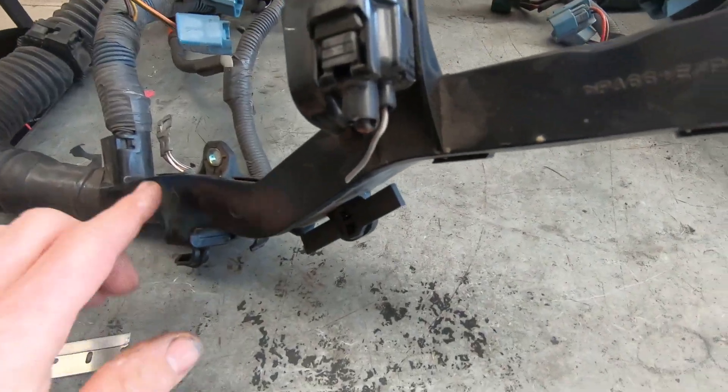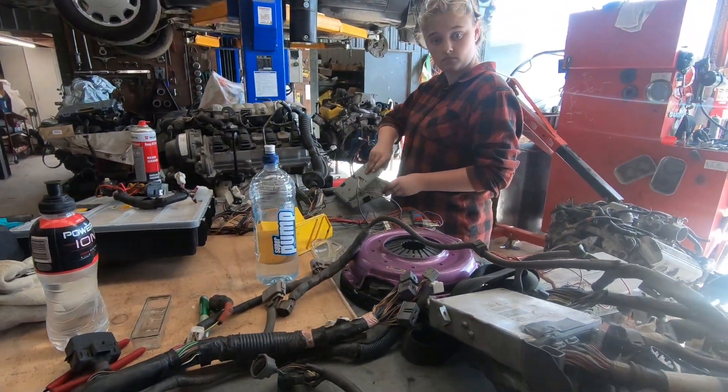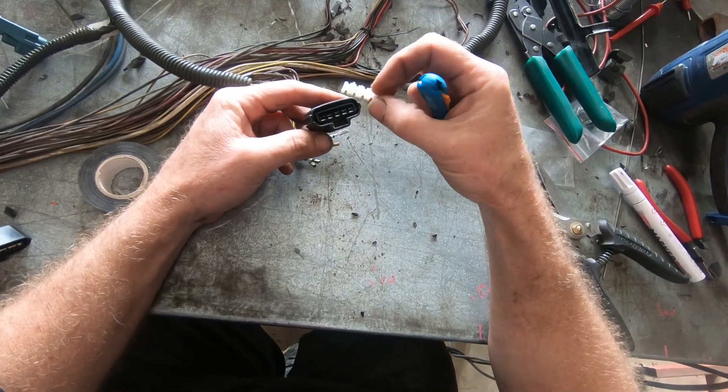There's some repairing for me to do, but first I'd like another set of covers so I'm going to harvest them off this job over here. My assistant will harvest the covers off this one. This loom is going to replace a UZS 131 loom — that job's coming up. I don't recommend mixing and matching looms, but when you have to, you have to. My assistant is going to harvest the plastic covers off this nicely so when I convert it over to a gen one loom, we can put a set of gen one covers on it. I'm starting with the igniter plugs.